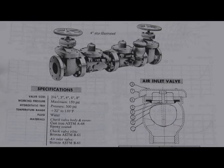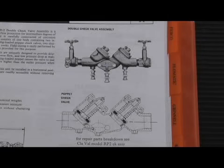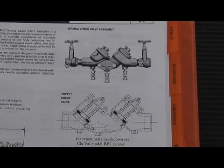And that's the larger sizes, meaning 2-inch through 10-inch, with the 308-1 and 308-4 type of checks used in the Model D and the Model D4, and also used in the Model 16 double check detector assembly and the Model 27 2-check pressure vacuum breaker. They did produce a Model D2 double check in the small sizes, meaning 3/4 through 1.5 inches. It was a bronze body construction with a poppet style check. Here's a picture of what the valve looked like, and a cutaway schematic of what it looked like inside the assembly.